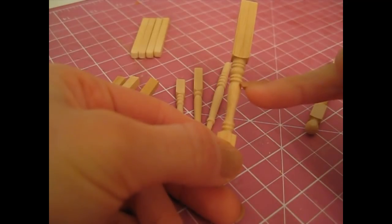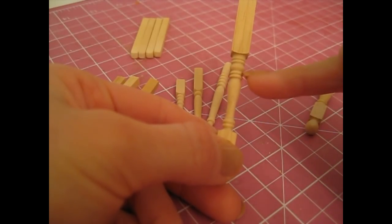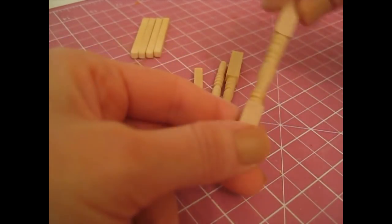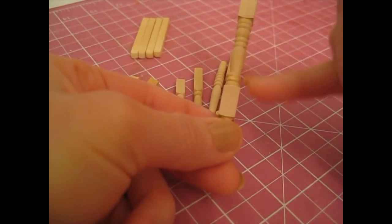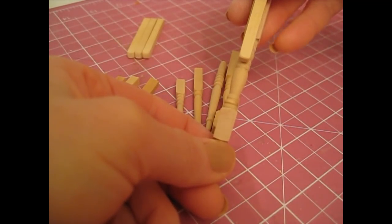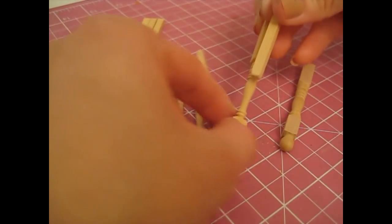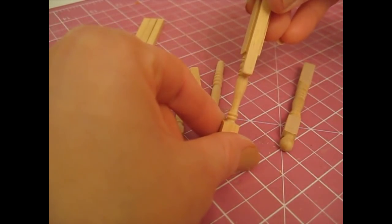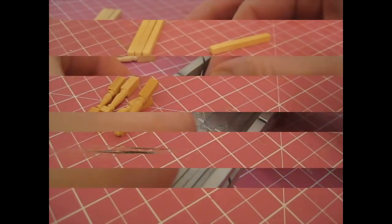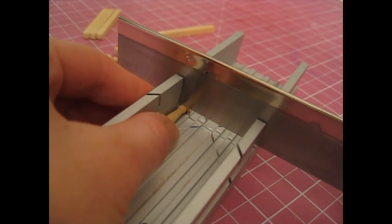Here's another spindle with a nice piece in the centre — you could use that shaped piece, maybe leaving one of the little ridges at the bottom. If it's more or less than 18 millimetres, that's okay; you'll just have a slightly longer or shorter leg. Bear in mind your top part of the leg is 5 millimetres, so you wouldn't want to go too thick — try to choose something that flows in nicely from the 5 millimetre leg. I'm just using my mitre block and saw to really carefully cut these, leaving the little raised bits intact.